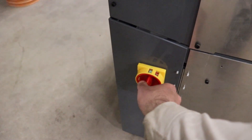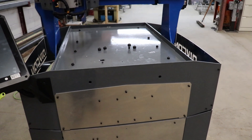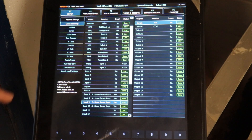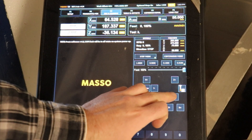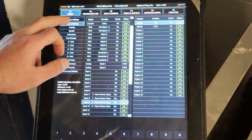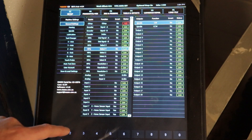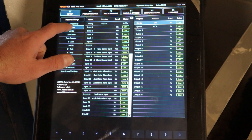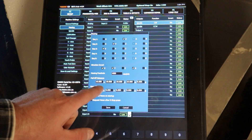Turning the machine on now — controller firing up. I'm still figuring some of this out, but here are the basic screens accessible from the tabs at the top. This is the jog screen with your free jog controls and homing, which will be the one displayed on startup. Here's the file screen where you can access the flash drive and load your code. Here's the setup page where all the parameters are set. General settings will display the programmable inputs and outputs as well as their current state. Here's where you'll assign inputs like homing sensors, alarms, stops, and switches, and outputs like pumps, oilers, and relays. Under homing, you can set the sequence, homing speed, and back-off distances for the homing operation individually for each axis.